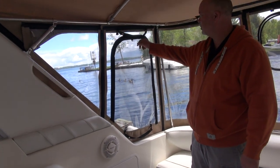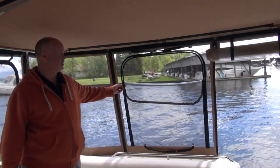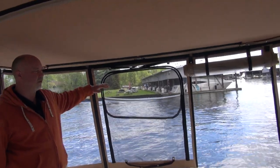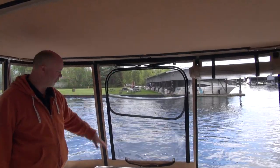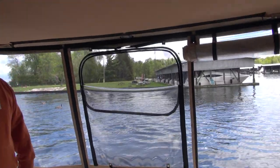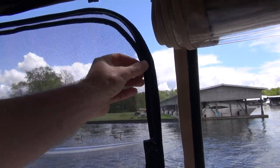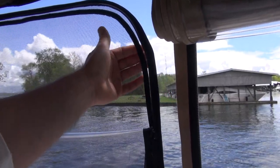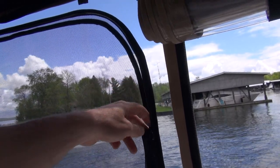We did all your zippers — we call them frowns, so they roll down, like a car window. If you roll it down a little bit, if you're on the boat in May and it's cool at night, you can just crack it to let the heat out. But with roll-up windows it's all or nothing — there's no in between. And beyond that, you overlap this zipper area so that where it's zippered it's not going straight to the outside elements. If it's raining, this allows the water to mostly run off and away from the top.